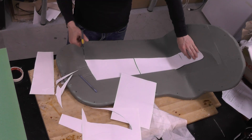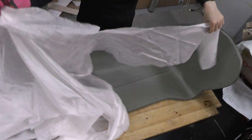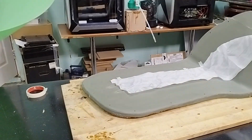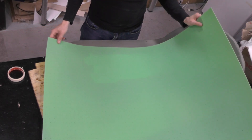The tooling is a fiberglass mold that I made earlier. We start by cutting a template for the future layup from sheets of paper. Next, we prepare the materials for our vacuum bag: peel ply, 2 mm foam core, resin flow mesh, and vacuum film.